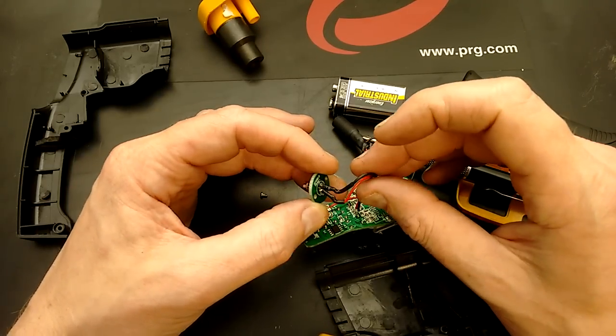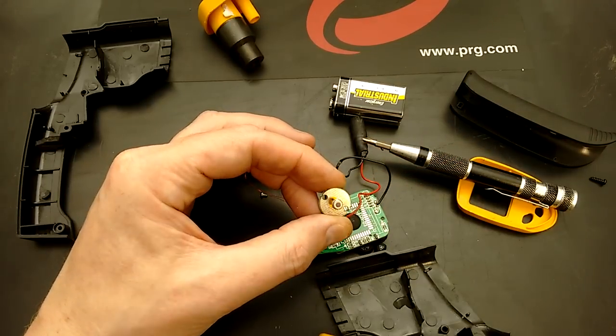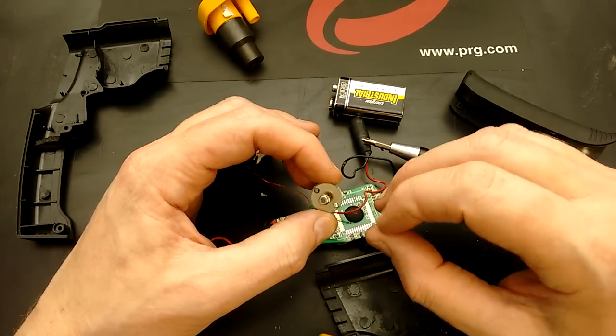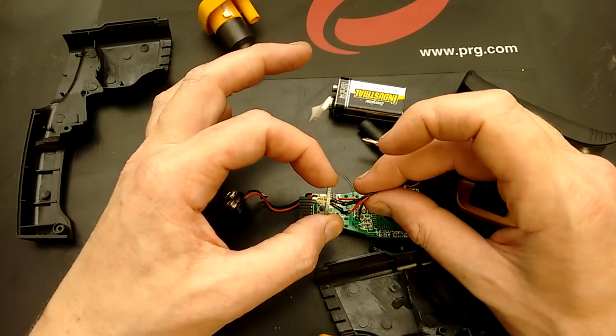So I'm guessing it's just going to be a pyroelectric device which is putting out a small voltage differential. I'm not sure if that will have some sort of amplifier in it, but I guess it could — like a lot of these devices, like the passive infrared detector units, use a little high-gain transistor inside to initially boost the signal up. I'm guessing that might be the same here, so it's basically acting as an analogue voltage output.